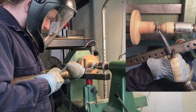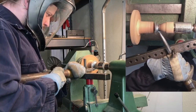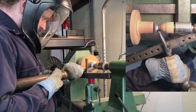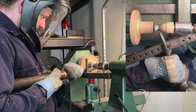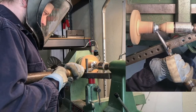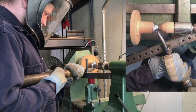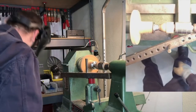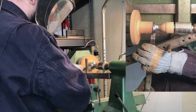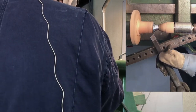So now with the oversized follower block, that'll keep the blank from tilting or possibly tearing out. With small-scale spinnings there's not so much force involved, but it does take a fair amount of finesse. Get your tool where it needs to go. I'm just going to trim that so it's nice and concentric — trim's nice and easy. The pewter is just a dream to spin with.